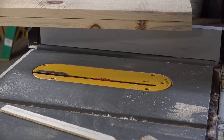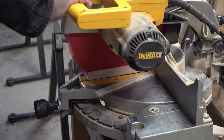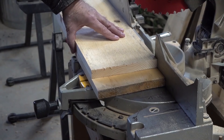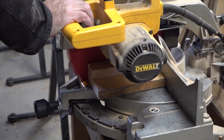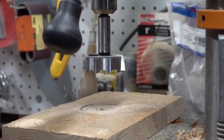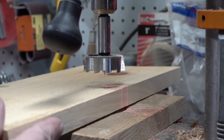I cut the pieces together because I want them to be absolutely perfect. You can see the bottom one was a little bit off — they weren't quite parallel when we began. Now we're cutting the final exact dimensions I need, because this is a floating piece that's going to go inside that frame we made — it's going to compose the bottom of it, like an inner cover integrated to the feeder shim. Nice and thick, and again this is just pine. The other thing is we have to cut that center hole because we're going to use a wrap-around feeder and you want to give your bees access to this feeder shim. I'm going to put that as near the center as possible. This is going to be really critical if you're making one for an eight-frame hive.